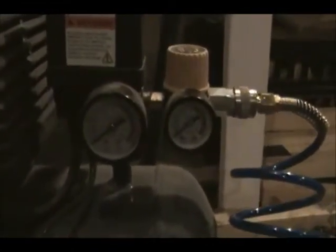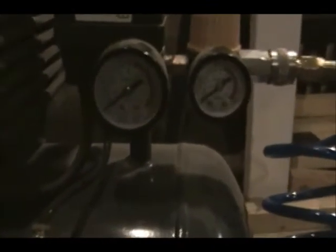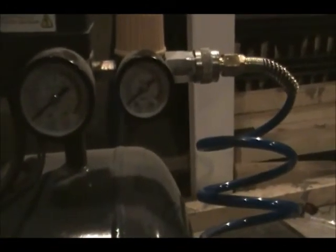All of these compressors will have two dials. The first dial shows the air pressure in the tank itself. The second dial shows the air pressure you're sending out through the hose. You always want to use the least amount of air pressure possible in your props — always start low and bring it up when testing. Trust me: I almost watched my pneumatic groundbreaker tear itself apart because I was running it at a full 110 PSI. Absolutely almost destroyed it; these things have a lot of force.